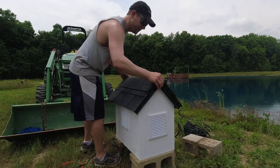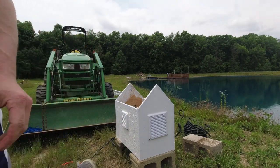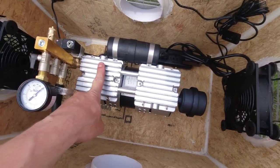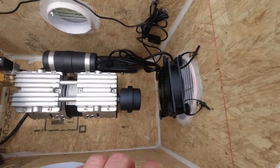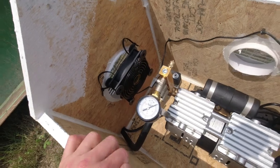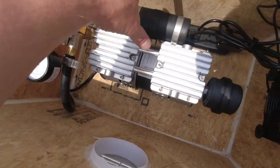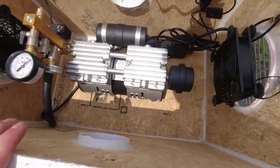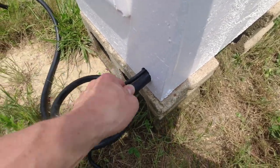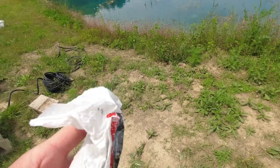I don't know who built this, but it's pretty slick. The asphalt roof just lifts right off — nice and heavy so the wind won't take it. Inside we have the rocking piston air compressor, a pair of cooling fans that exhaust air out, a little power strip for everything, and extra space for airflow. On the end I have six-inch vents for the fans and two four-inch intake ports on the sides. I made sure to caulk and seal it up nice so nothing could get in, with one entry-exit point for the electrical and hose, which I'll be using duct seal on.